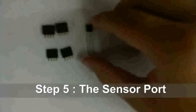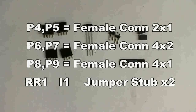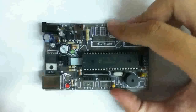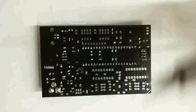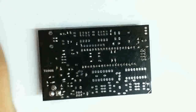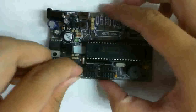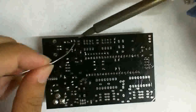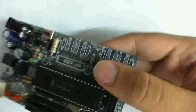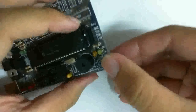In this fifth step, you will be assembling the sensor port. You need the sensor connectors, the infrared receivers, and a few other parts. The assembly procedure is pretty much the same — you put in the lower profile parts first, and then the sensor connectors. The only thing to be careful of is that the sensor port connectors tend to get bent quite easily, so please check regularly whether or not they're sticking out straight. Also put in the infrared receiver — we consider this part of the sensor circuitry. It allows you to receive commands from any Sony-compatible remote control.